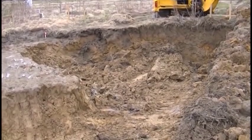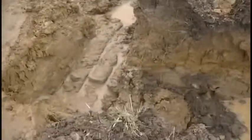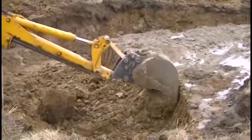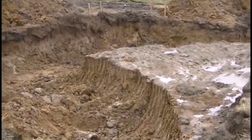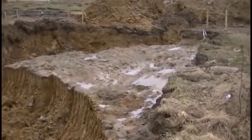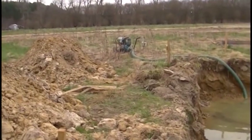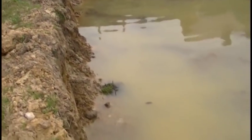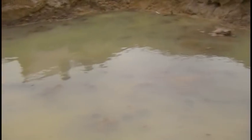If we fail to make it in time, we may be faced with the situation seen here in the example of the second pit made on the same plot for a utility building. Here the ground is lower and the water table appears at the height of the foundation. The pit was made approximately one month later — please notice how the situation looks. The loam is softened and damp, hence there is absolutely no chance to erect anything on it. It also lost its bearing capacity, and as an aggregate is not suitable to be compacted. I decided to dig the pit around one meter below the level of foundation. Please notice the result is quite a sizable lake — all water from such a pit must be removed, most easily by draining it with a pump, exactly as we can observe in the film.